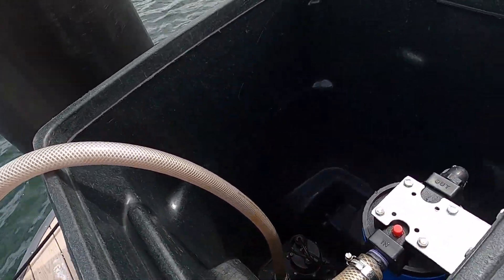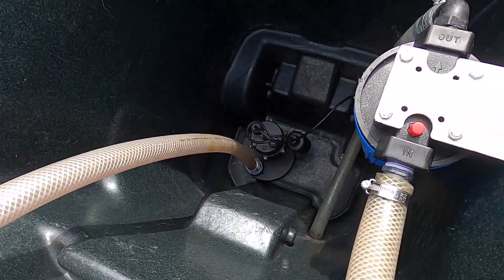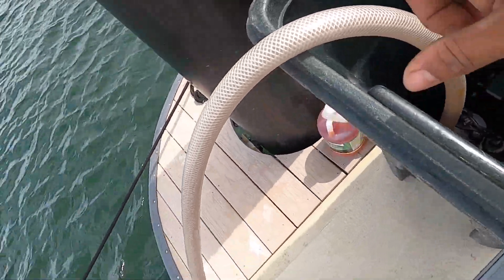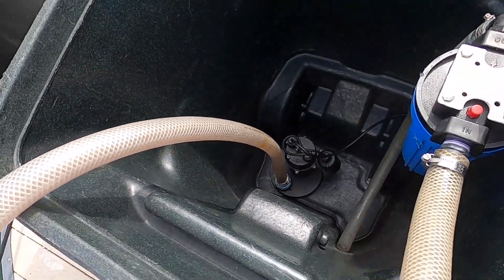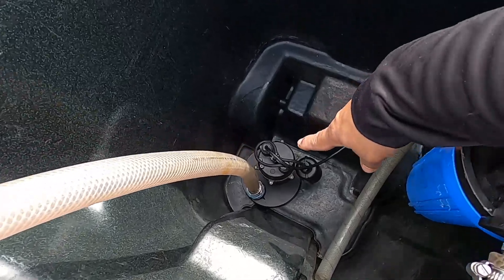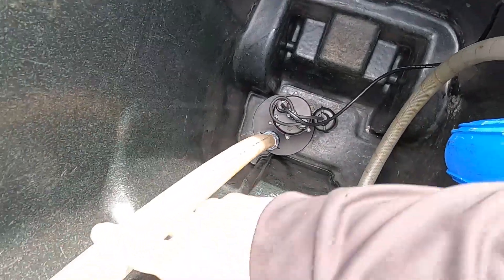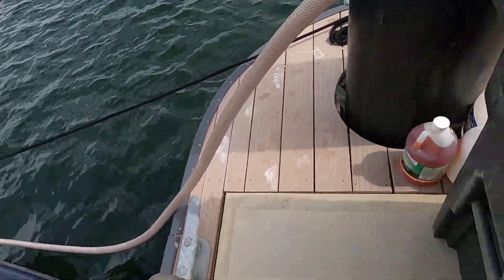So this is my bucket — it's a regular garbage can from Home Depot that I prepped up to do this. It's good because I can store all my stuff in here and put it in the van, so I don't have all these fittings and 100 feet of hoses laying around in the truck. I added a filter to catch any of the debris that comes loose. You got a submersible pump right there. This is the line that goes into that discharge of that pump, and this is the line that comes back from that fitting on the wall.